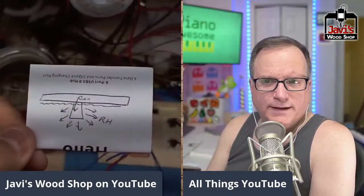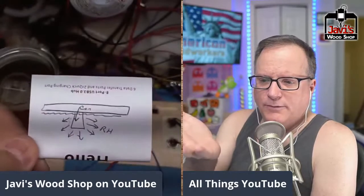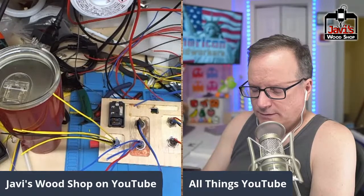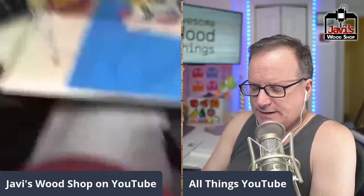The little things that go from the... Well, you don't need baffles. You just need an airspace. But sometimes they have them from the soffit. Yes, they have these ridges, so the air can come up along the wood. And they make those for when you insulate, the loose fill insulation. Because if you insulate, you don't want to insulate up against the roof. You want to have that airflow.